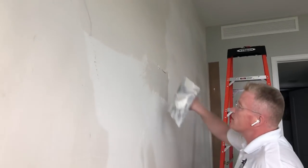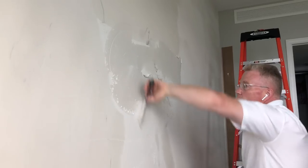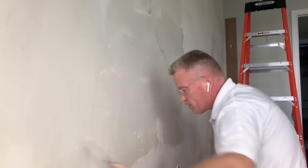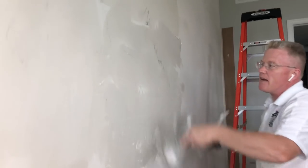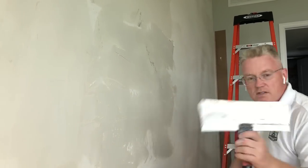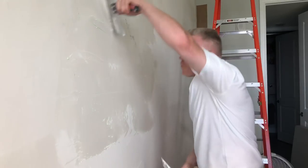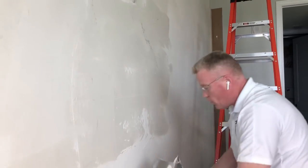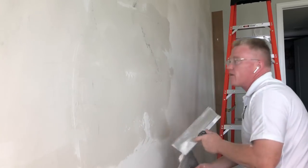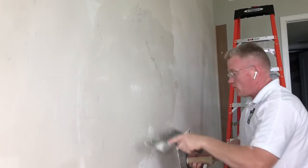There are a couple ways to spread it initially: you can just take the blade and put that on the wall, or simply put it on the wall and make a motion like window cleaners do — this spreads it around. I spread it out over the course of about two and a half feet. I don't work in very large sections — about three by two or three by three at most. Always clean your blade because this stuff dries and little rocks get in it, then you're dragging rocks through your compound. Now the key tip: a sweeping motion, press firmly against the wall, and hold the blade at a 25-degree angle. You will leave the proper amount of compound on the wall without taking too much off.